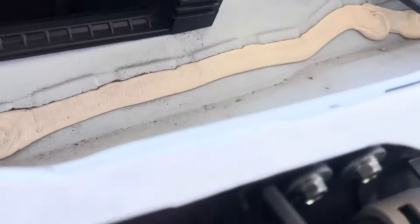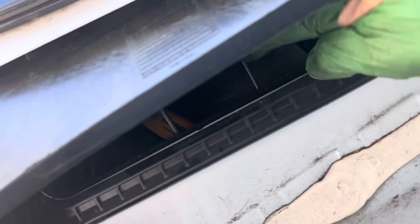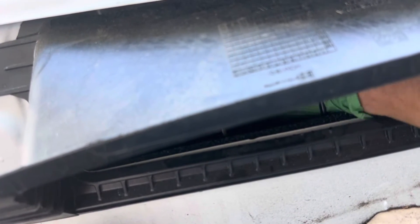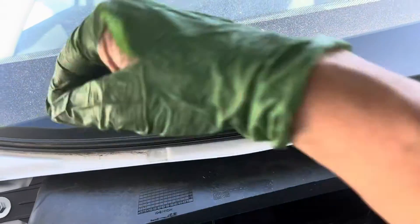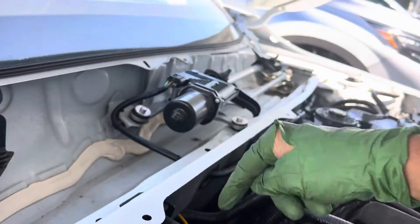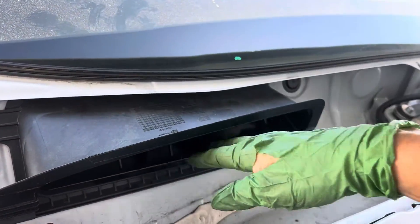Let me stick the sensor all the way down there, on top of the filter. I'm getting the temperature of the air. This cooler air up here is being sucked in — if there was smoke, you'd see the air rolling down and being sucked in. This air in this area is cooler than the air over here. With a smoke machine you would see the air flowing in. That is 90 degrees mixing with air that is 67 degrees.